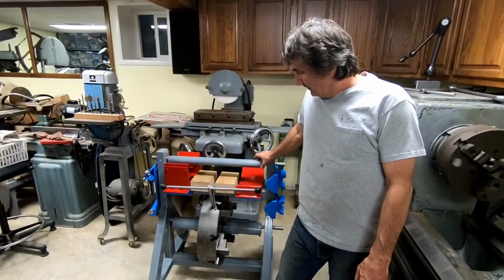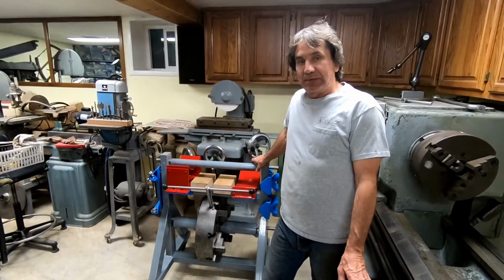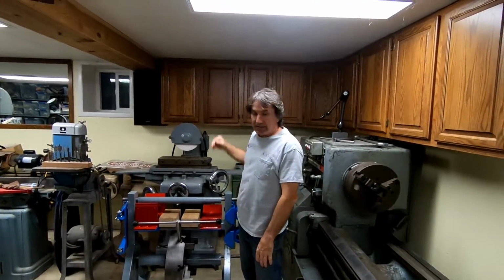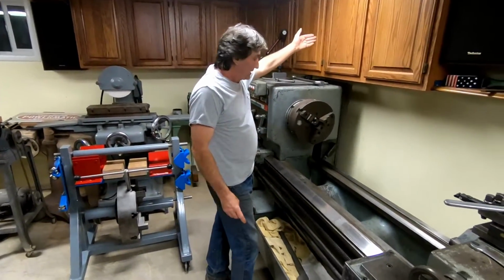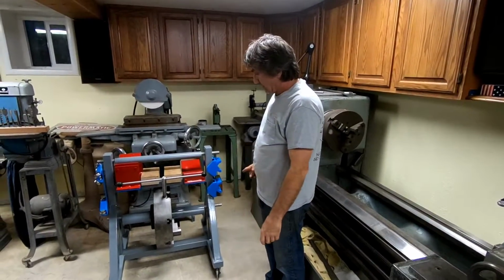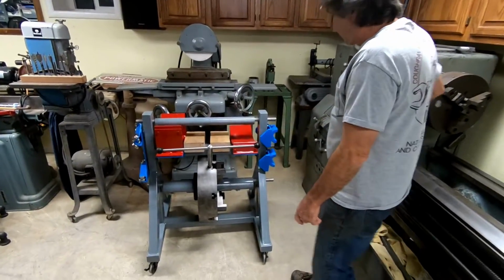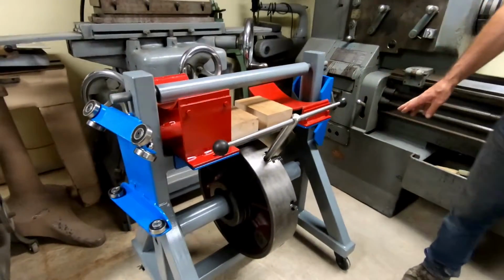It is a 200-pound chuck, 20-inch 4-jaw with a L2 spindle built right into it. I needed a way. As you see here, I don't have a whole lot of height in here. I don't have room for cherry pickers. I really didn't want to build a swing for the chuck, but I needed to be able to get the chuck on and off. So I basically built this rack and all the attachments for removing the 12-inch chuck and installing the 20-inch chuck.